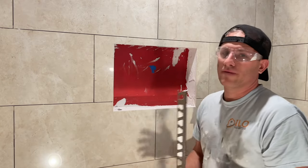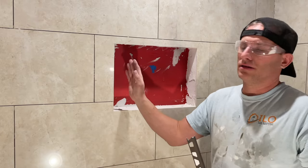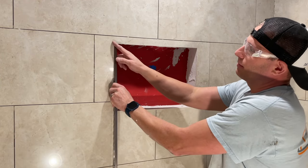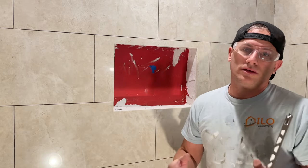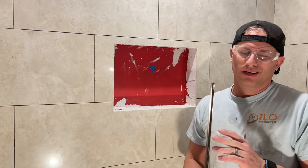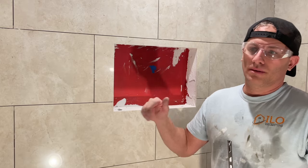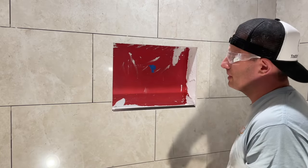This video is about doing it like a picture frame. First step: make sure your mortar is clean so you can place your tiles with no problem. Second step: I'm going to cut these jollies on a 45-degree angle to make a frame. I use a miter saw with a regular blade — it's aluminum and cuts pretty easily. I'll cut the bottom and top pieces first.